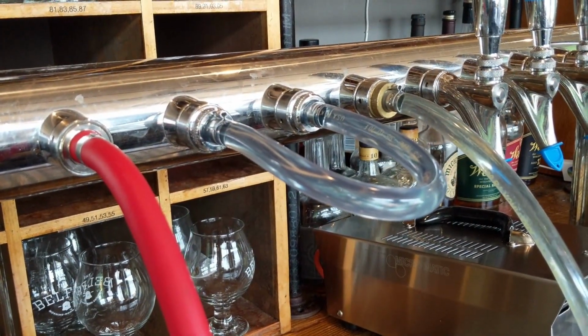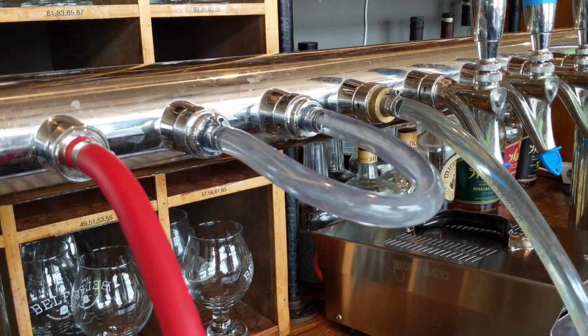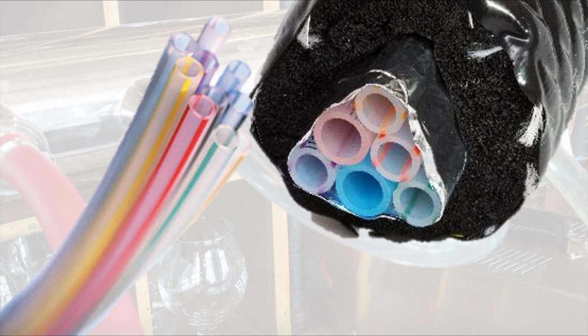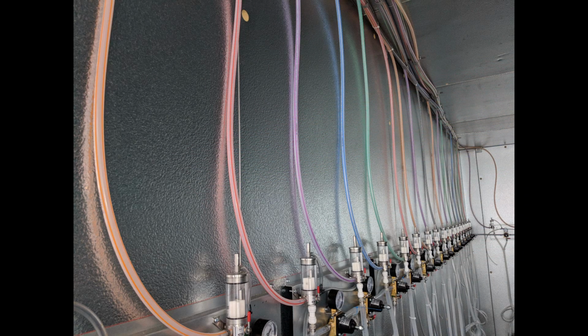At first, leaving water in the lines seems like the simplest solution since you're already rinsing line cleaning chemicals from the system. But there is one potential issue. It turns out the free chlorine found in many municipal water supplies can absorb into certain types of tubing, leading to off flavors in your beer when you go back to pour. This happens mainly with some types of rigid barrier tubing commonly found in glycol-chilled systems. So if you're going to leave water in your lines, it needs to be dechlorinated water. A quick and easy solution is to buy a few gallons of distilled water at the grocery store and use your pressurized pot to pack the lines with that.